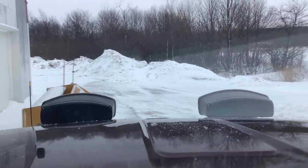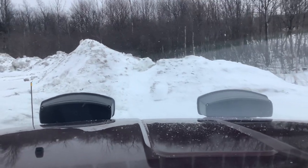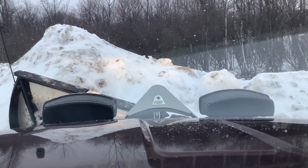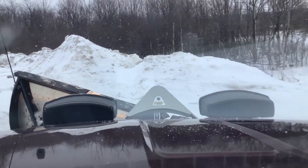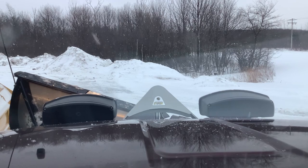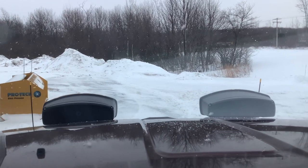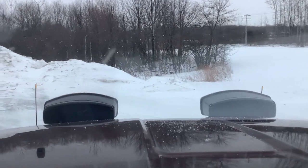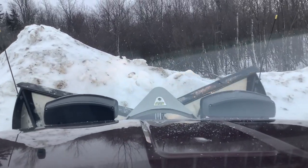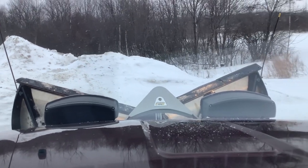Usually when the spare pusher is not here, I go right across the front. You can hear the frozen ground. It's almost like a rough driveway, even though this is pretty smooth in here. There's a lot of ways to clean this up now. I can push it all away, and there's not that much, actually. If you watch the blade here, I can put it in the scoop mode. There we go, she's in the scoop mode. This will take what's out in front of us, that little ridge. It's not enough to build up and run out both sides of the blade, so it acts like those scoop shovels you use on your driveway, and you can just push it out of the way. You can roll it over into a windrow and then push the windrow out of the way.